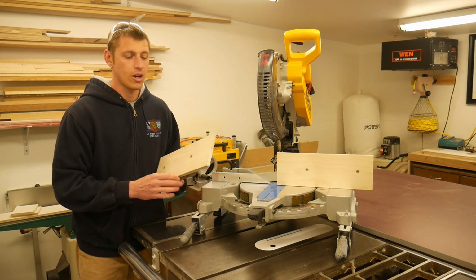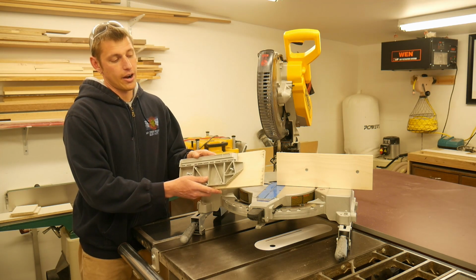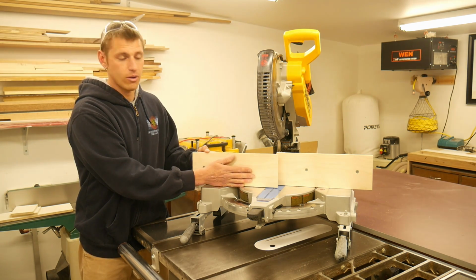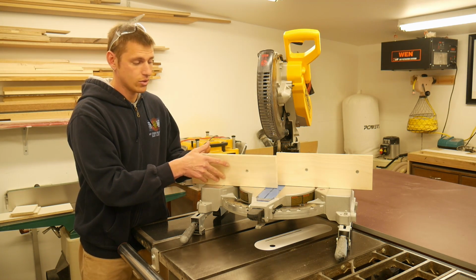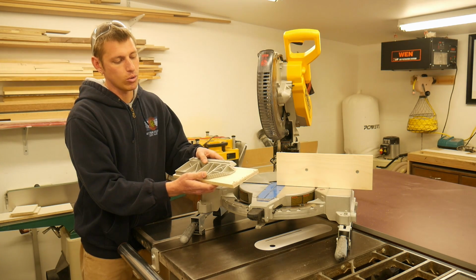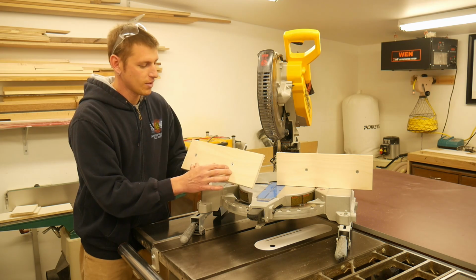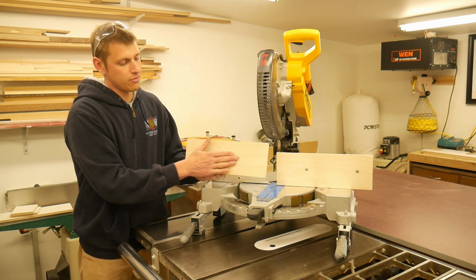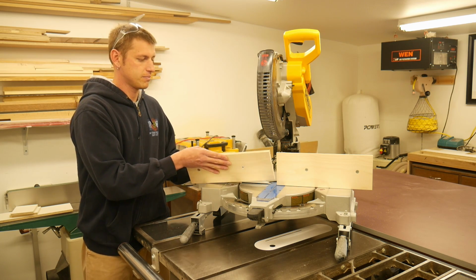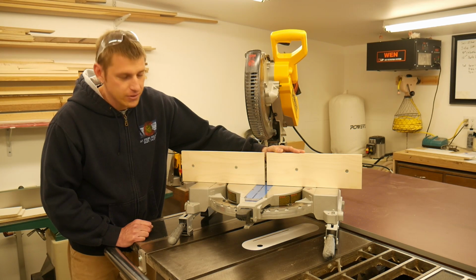After we made our cut on the table saw and did our 1/16 round over, time to install it actually on the fence itself. I already have it installed here, so put the wood down with the round over bit on the base. Drew a couple little pencil marks in there and actually used a tapered bolt with a lock nut that I countersunk into the wood on here, so it's flushed up and you don't have any wood catching on it, just a little bit underneath.